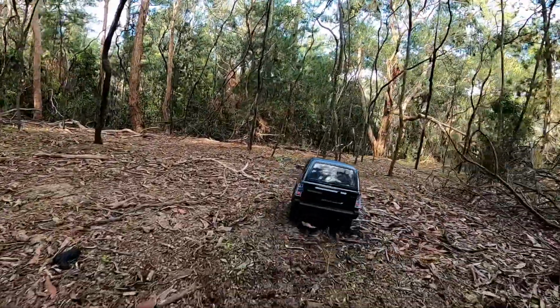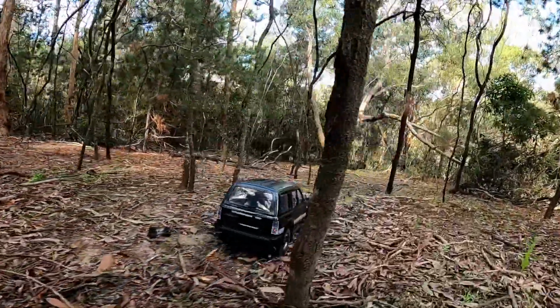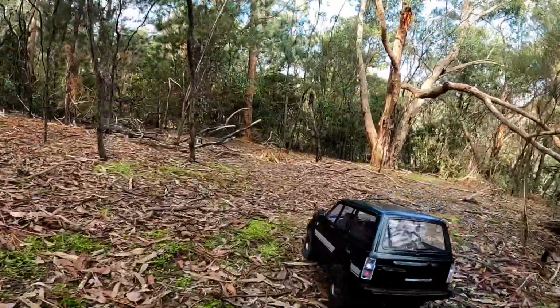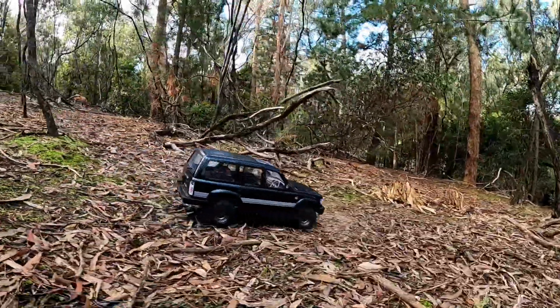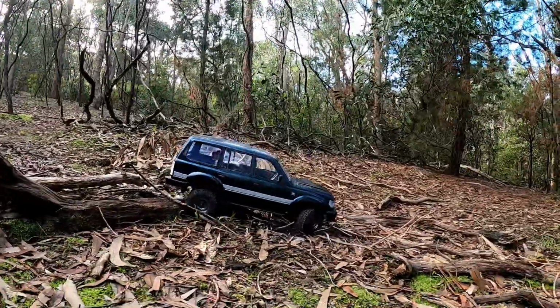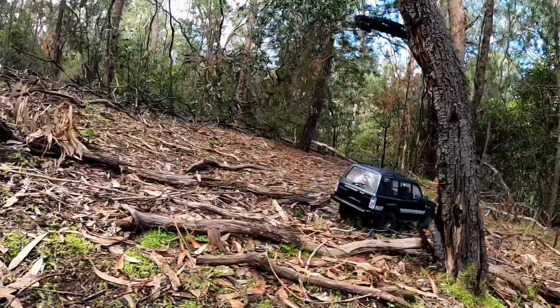I'm using a KillerBody Light Kit, which modulates the LEDs. It doesn't look great, which is why it looks like it's flashing on camera. The idea is it flashes more slowly to make them dim, and it flashes more quickly to make them look bright, all the way up to no flashing, just full power. It's a power efficient way of driving LEDs, but it doesn't look great.